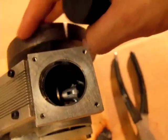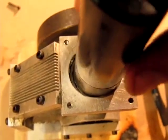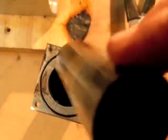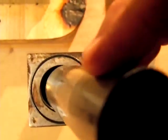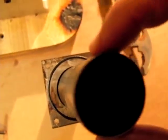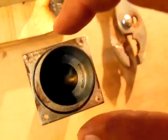Let's see if we can get that all the way down — this actually is pretty close to a perfect seal. It's not perfect, but it's a really good seal right there. So the tolerance between these two — this is the top cap — it is almost a perfect fit. And that's probably the secret to the power of this engine: there is very, very, very little air transfer. Most of the other Stirling engines that I have, this is probably three to four times the airspace between the two.